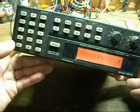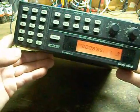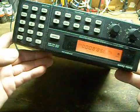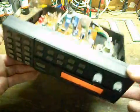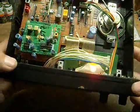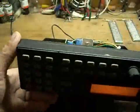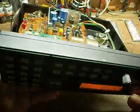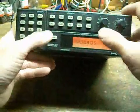With this radio, the local oscillator appears to run from about 118 megahertz all the way up to 163 megahertz. So if you need a signal source pretty much within that range in five kilohertz steps, then it's pretty simple.